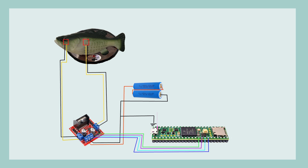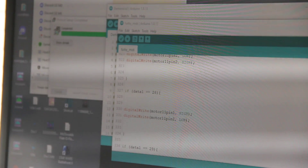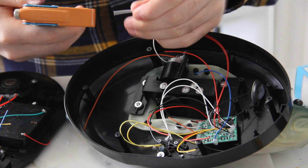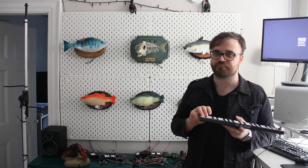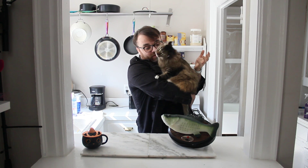Then the four data connections from the driver to the Arduino. Connect the batteries like this and then run the USB cable from the Arduino to your computer running your digital audio workstation. I have many notes mapped out in Ableton to be sent to the Arduino controller that tells the motor drivers which way to direct the flow of electricity to each of the motors. So if a specific note is hit, a specific motor turns in a planned direction.